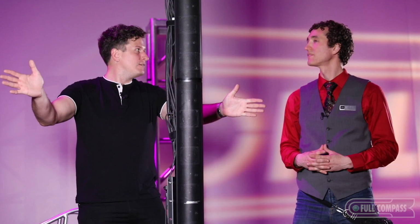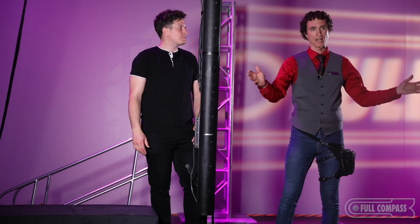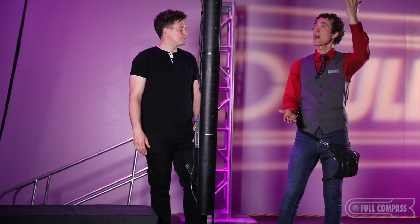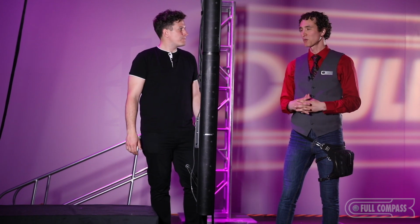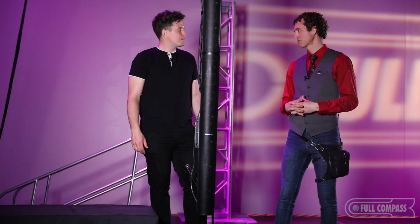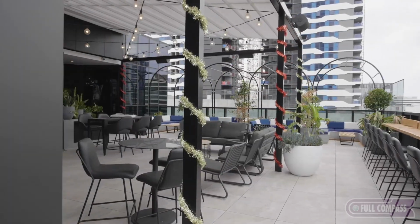What is their spread? So these loudspeakers have 160-degree horizontal coverage, so very wide coverage. Can cover a wide area. And again, the vertical coverage is going to depend on how tall the column is, which of course affects how far out they throw. And these also can connect to that sub right there as well. Exactly. As we said before, everything that we're talking about today can pair very well with the MB210 subwoofer. We've had systems where we're utilizing all of these products in various different areas.